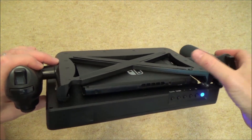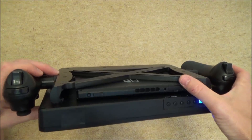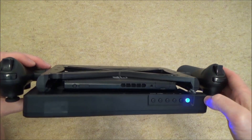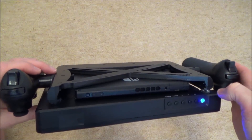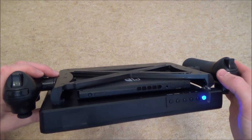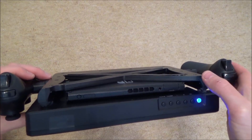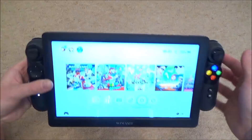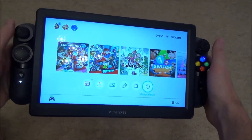With this particular portable dock I'm using — it's like a fast snail one — it allows you to dock the switch with just five volts. In here I've got a power bank built in that's outputting two lots of five volts: one to feed the monitor and one to feed the dock. And then out of that I've got a Magic NS adapter which the controller is connected to, so it's just mimicking an Xbox 360 wired controller.